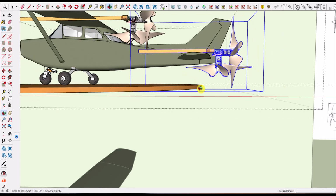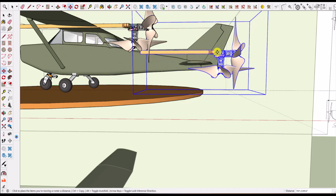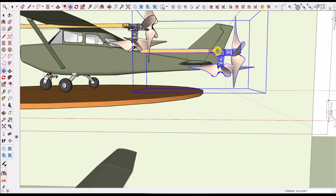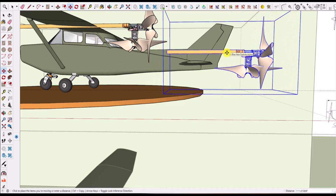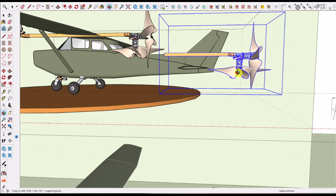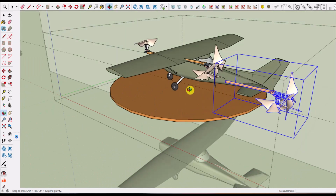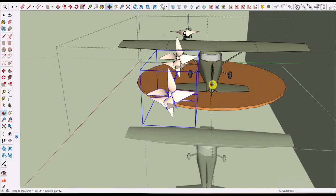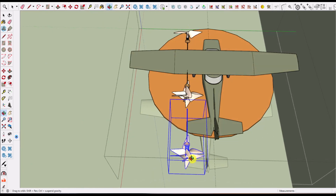which means that what you're going to have to do to get this to work is to elevate this, let it be a pushing prop, and elevate it in this kind of a configuration. And then when you're landing, it's not going to be that close to the ground. But you dramatically increase the length of your plane, and you have all this lift way back here in the back of the plane when most of the weight is up here.